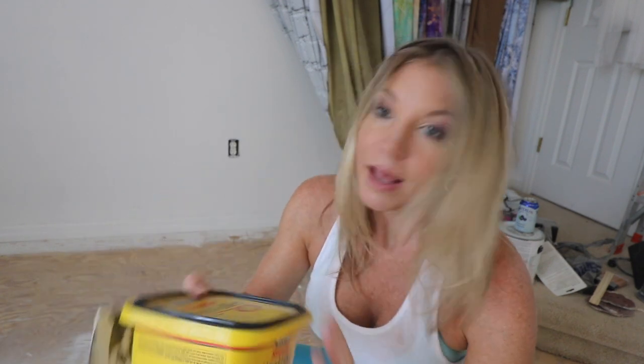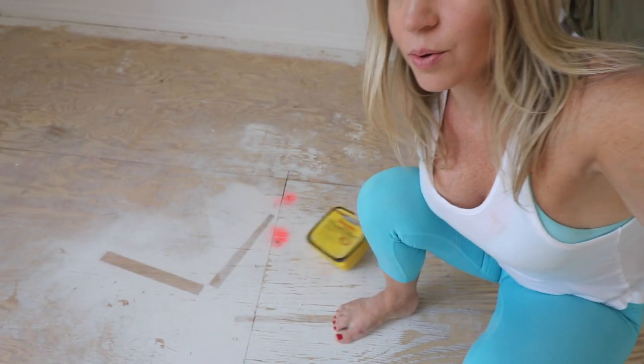Now I have the floor sanded and ready for the wood filler. I ended up sanding the whole floor because there was a lot of overspray from the build of the house and I wanted a completely smooth surface for painting. I'll post the link below so you can see exactly what wood filler I'm using. I'm going to use it on the cracks — as you can see there are cracks here — and also I'm going to pay attention to any nails that need to be tapped in a little lower and fill those nail holes with wood putty too for a more uniform look.